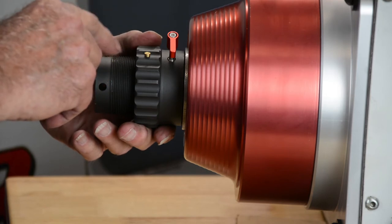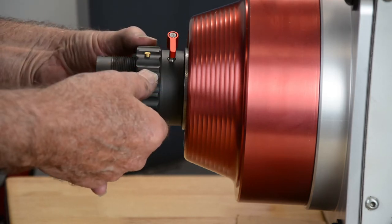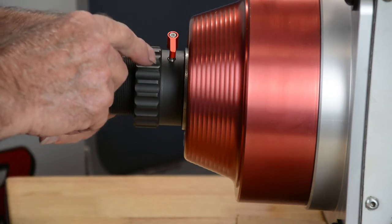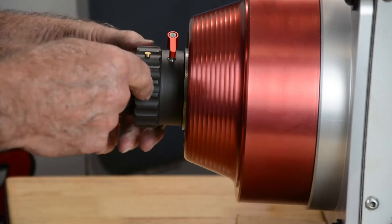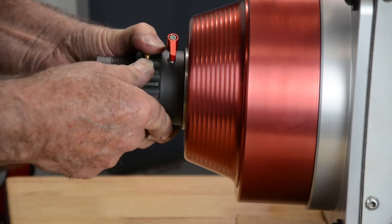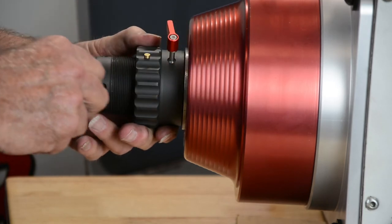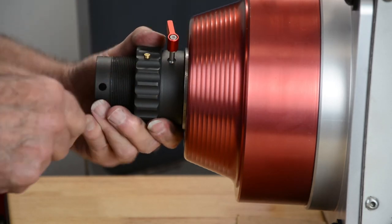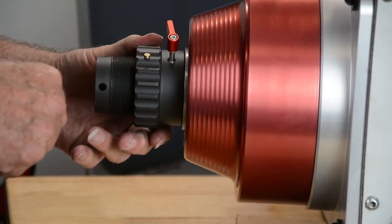And this brass pad is a thread protector. So if you ever remove this collet adjustment nut completely off the feed tube, this brass pad is going to fall out and it may get lost, so keep that in mind if you ever remove that. So what you do is you adjust this against the washer and then just tighten it down finger tight against the brass pad, which will push against the threads, and it doesn't take much to hold it in place. It's not something you have to over tighten.